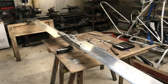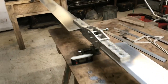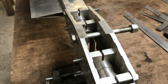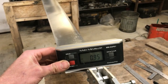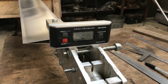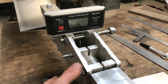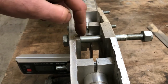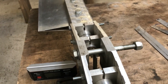The last thing we need to do is find out if the rotor system is balanced as a whole in the chord direction. What I've got here is it balanced on a bolt on a single piece of rounded flat bar so it can tilt where it wants to. I've then got a digital protractor inclinometer placed on top, and we can see that it isn't level. We need to shift the rotor left or right to get this to read zero, then measure the distance and use shims inserted there to shift the whole rotor to one side so that it's balanced in the center.